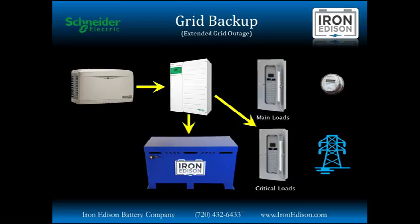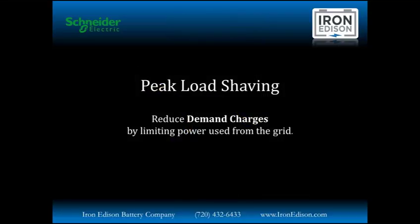If we find ourselves in a situation where the power outage is going to last longer than the battery capacity, don't forget we can plug a generator into the XW Plus inverter, and by leveraging the abilities of the auto gen start, once the battery state of charge drops down to a level we define, that'll trigger the generator to automatically start up. And while the generator's running, the generator power will be routed to our critical loads to give them first priority and keep them up and running, with any surplus power production from the generator being used to recharge the battery. Once the battery is fully charged, the AGS will see that, tell the generator to shut down, and we'll just continue operating on the battery until either the battery discharges to that point again or the grid returns.